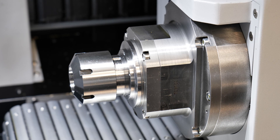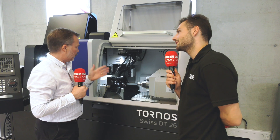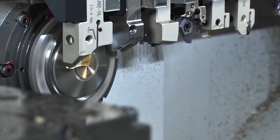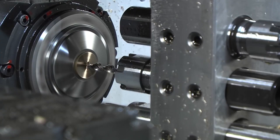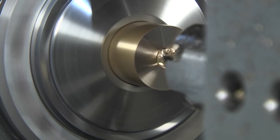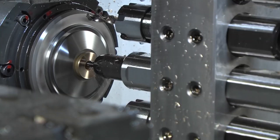For other types of features, there are options for gear hobbing, polygon turning, and thread whirling. You can also have high-frequency spindles. So there's a lot of flexibility in what is, as we term it, an entry-level machine — with five linear axes and two C-axes.